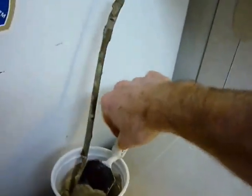I'm spreading the grout using this trowel here, and I'm just getting it close. I do have a grout float, which is like a rubber pad on the bottom of a handle, and we'll get to that in a moment. I just want to get this going here. Put a lot of extra on there because you'll see it's very easy to wipe off when you're done. Sometimes it's hard to get in that little corner down there, but that looks pretty good. I'm even getting underneath the cabinet there to help provide a seal.